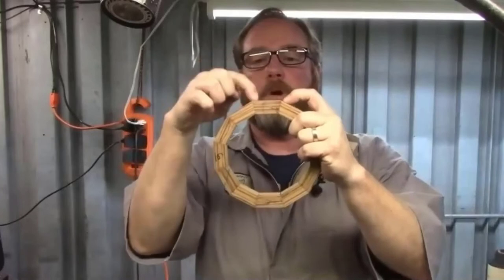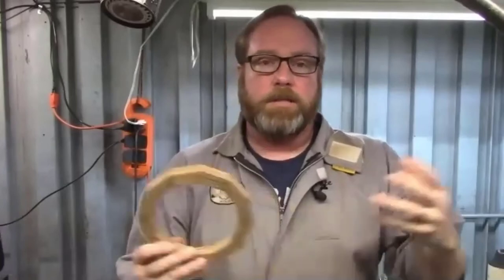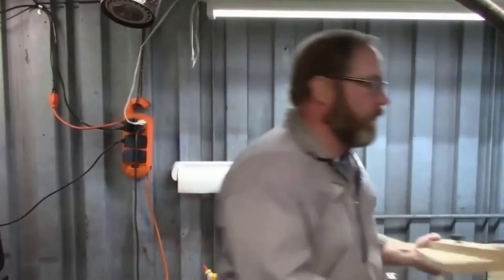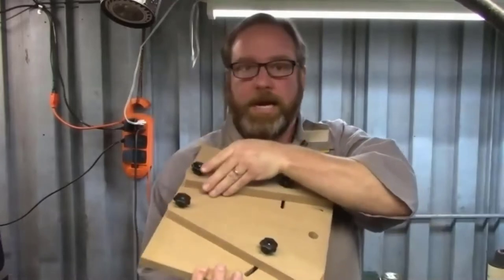Okay, so you can actually mathematically figure out what you need. If you take from your chart the length measurement, the dimension from the widest point of each board, and unroll this segment ring, you will know exactly how long the board needs to be. Plus 1/8 of an inch or so for the saw blade cut, plus a little extra because you need some amount of wood to hold on to here on the wedgie sled. So if you've calculated everything out exactly, you should end up with about maybe 4 inches of scrap in the wedgie sled that you're holding on to.